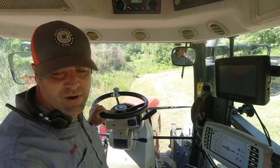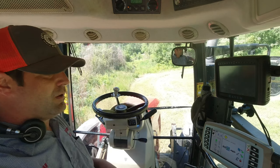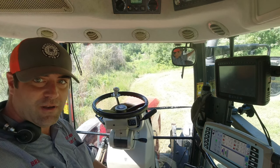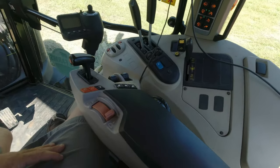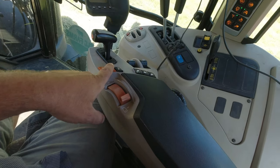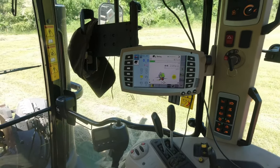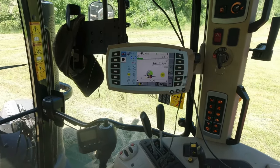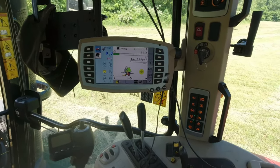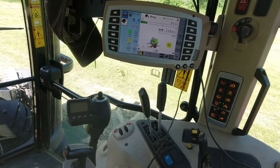All right, I'm gonna get y'all turned around where you can kind of see the baler, and we'll fire up. Let's make the first round bales. Let's get the tractor set up. So I'm gonna show y'all real quick. All right, so here in the Massey, it's fairly simple setup. Right here we've got a preset button for our RPMs. We just go ahead and power the baler up right there. We're gonna flip a switch right here. This is gonna be our monitor as well for the baler. This has ISO bus on the baler, and it works directly with the ISO bus on the tractor. Now we'll hit our A button there and idle up.